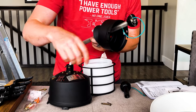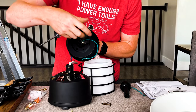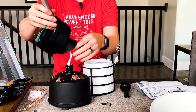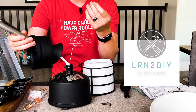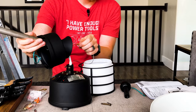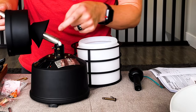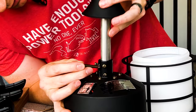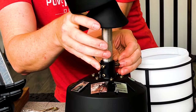If the wires aren't going through easily, pop this off, loosen this one screw, take the rod out — that'll make it easier to push the wires through. Once you've got all of them through, there are two screws on top you want to loosen. There's also this optional cable — a security fallback — but depending on your length you may not need it. Feed the rod back through, keeping an eye on the holes on either side to match them up with the holes on the base, then put the cotter or clevis pin in.